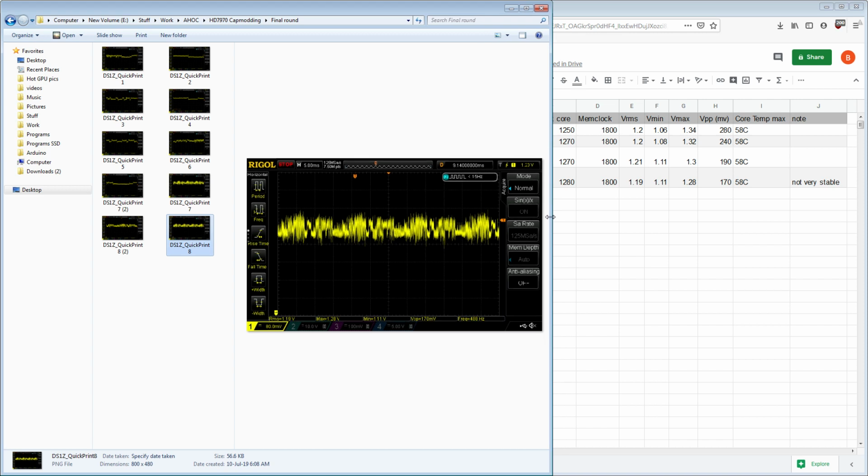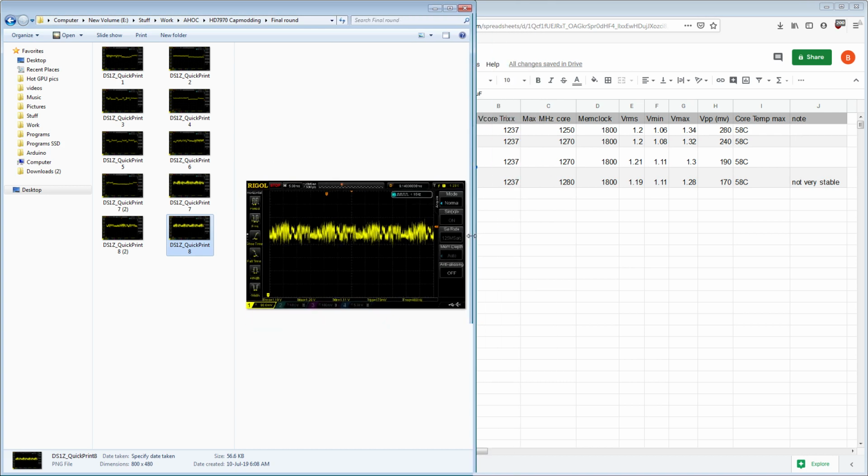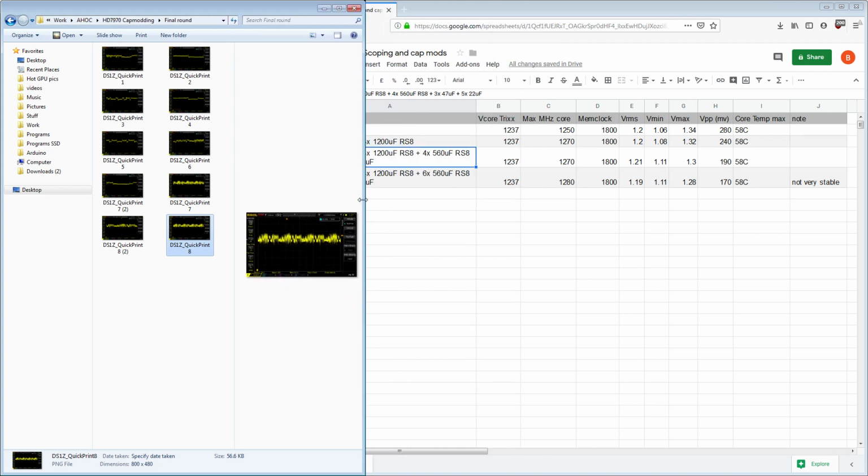So it feels kind of like that's the thing, well, I don't know. I really don't know. I think that board already is like 40 millivolts peak to peak though, even under worst case scenario loading. So I'm not sure. Well, no, because here I'm still bumping up against the load line calibration. On the Gene, I guess I can just set the LLC so high that it'll still be overshooting and undershooting really hard, and then I can start adding the capacitors, and it might help.